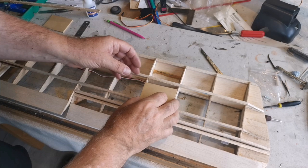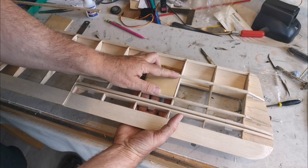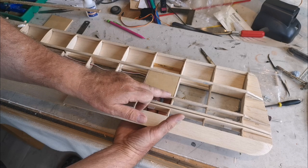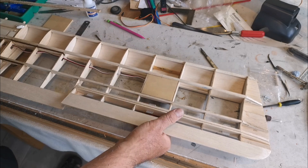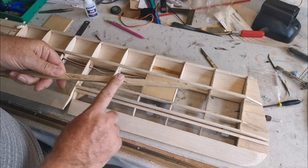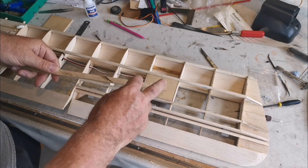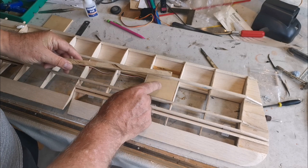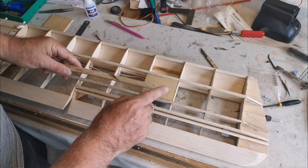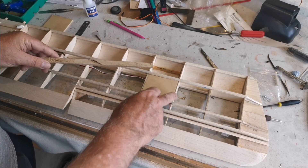This thing is the hatch and if I pop it in you can see it's a neat fit. Now obviously we need something because this is a hatch and we need to remove it to get access to the servo. We need something for that to be screwed down to - there'll be a hole in each corner and four screws to hold it in position. For that I need some hardwood, and I happen to have ash available - it's a very tough wood and it holds a thread really well. So if I have to take it off multiple times it's not going to become slack. So I'm going to make four blocks to go behind here.